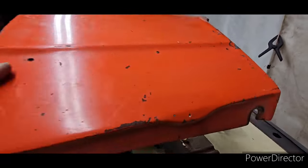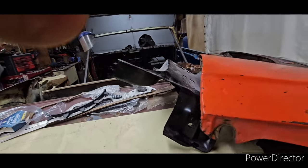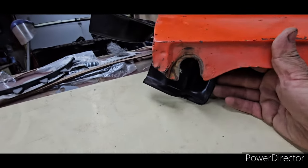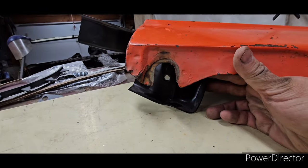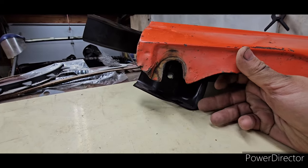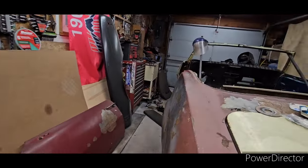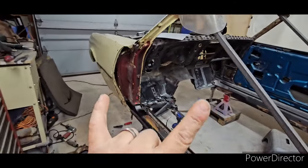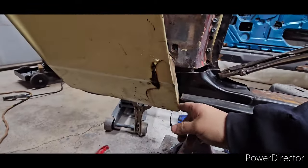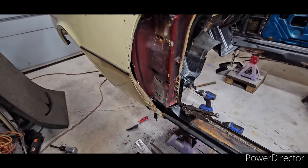That's where the A-pillar is going down. This is going to get mounted on the car pretty much like this. You want to make sure that hole right there for the bolt is lined up — you see how it's in the center of the mounting bolt. The one you're about to repair and the one that's going to go on the front attached to the rockers are exactly 12 inches apart, so when you bolt your fender you have no issues. Also, from factory there's a very small gap here on this panel, which they usually seam seal. I'm trying to get it exactly back to original.